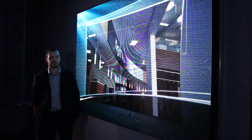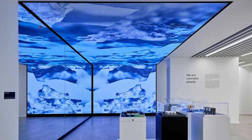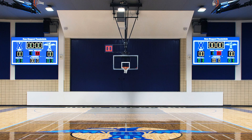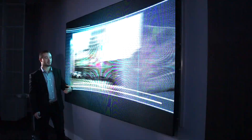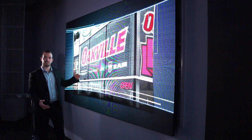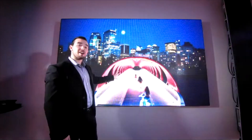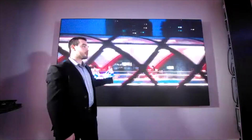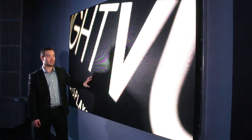I'm standing in front of one of our flagship Aurora series LED displays. Aurora series is an indoor, wall-mounted product available in 16x9 and 16x10 aspect ratios, and can also be built in custom panel sizes for special cases where our standard cabinet sizes won't fit. The product is available in 2mm, 2.5mm, 3mm, and 4mm pixel pitches, and it's built downstairs on our production floor here in Canada.